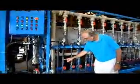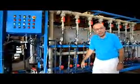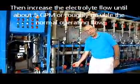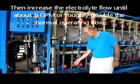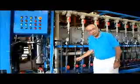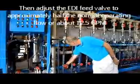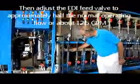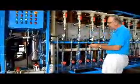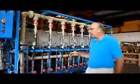So we get up here 5 gallons a minute or about 20 liters per minute. We can increase the electrolyte flow also to about double. Get that up to about 0.5 GPM or about 2 liters a minute. We will then cut the feed flow in half. So if we were at 25, now we're going to come down to around 12. So the result of this is we're reducing the recovery by about 50%.